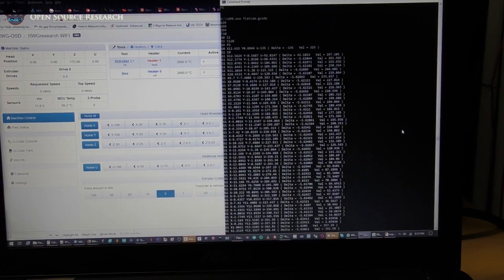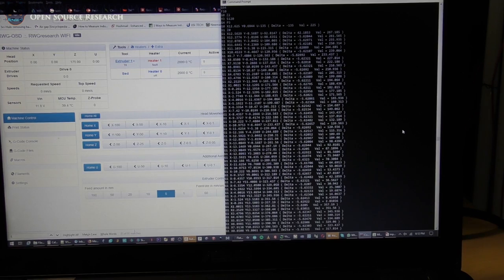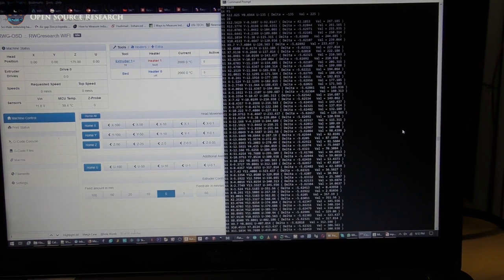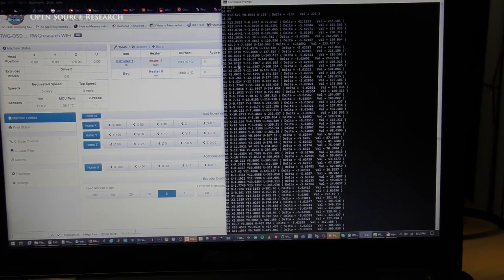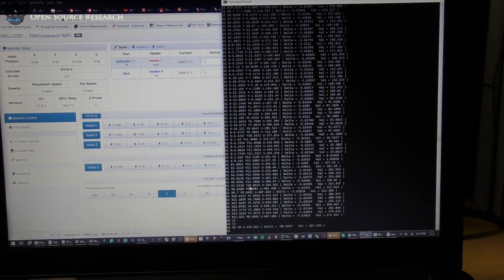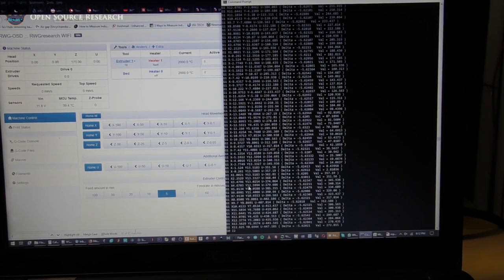So this is basically just a simple circle. That's it. So it just spits out the proper command for the U value. Originally the file is just X and Y, and then it recalculates for the direction according to the vector, and it spits out the U value. So I'm actually going to try running this exact one. It's just a simple circle, and we'll see how it works.